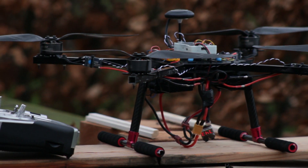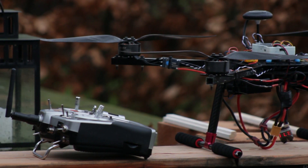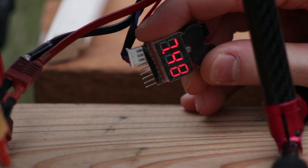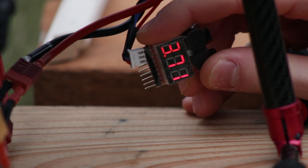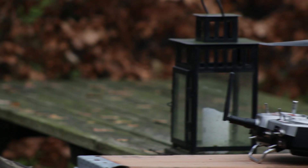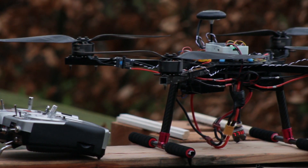I switched out of auto mode and landed the drone. When I checked the battery, you could see that there was still quite a bit of battery life left. The cells were about 3.7 volts, but you could have brought them lower to about 3.6, and I think that could have added about 1.5 kilometres to the range.